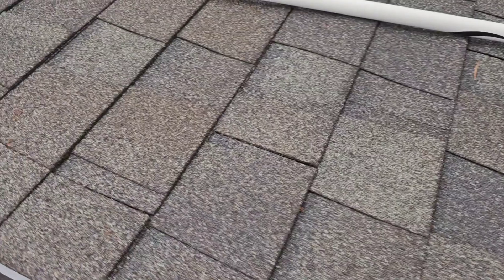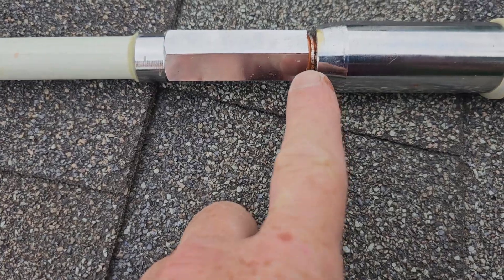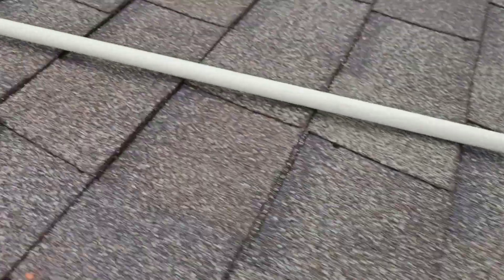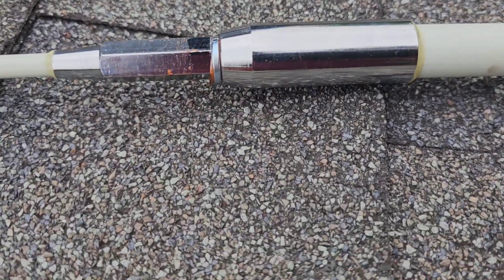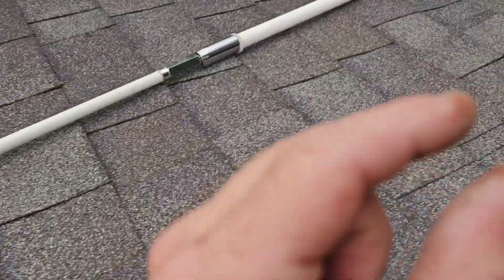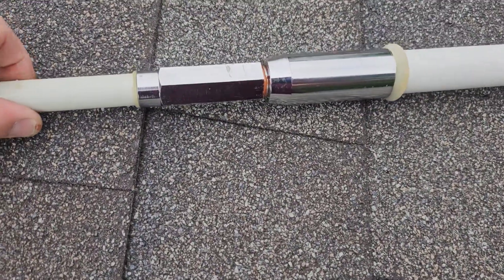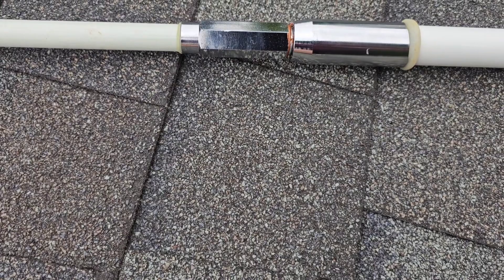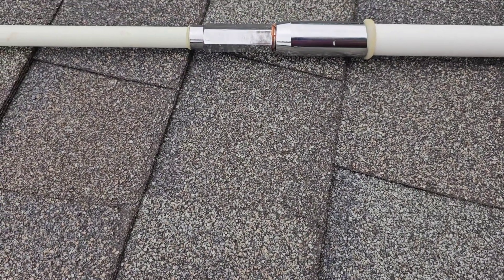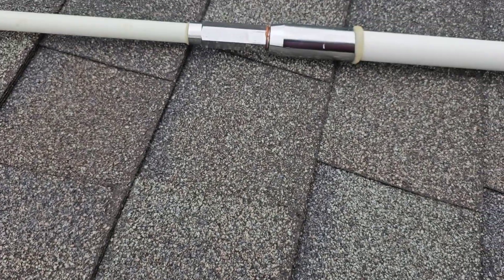Here's the rest of the mounting equipment. If you look right in there, there's actually a lock washer that's got to go in on each section that it comes with. Now they're screwed together and the lock washer is compressed — not over-tightened, as you can see it didn't spread the lock washer. That's a common thing people do — they tighten everything too tight. Really, once a lock washer gets compressed, that's all it needs. You should not tighten them so much that it actually spreads the lock washer gap.